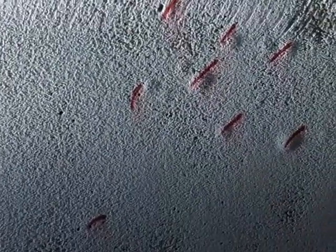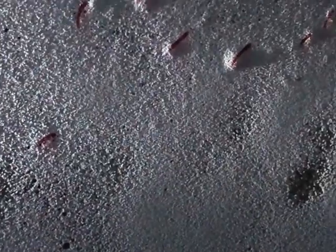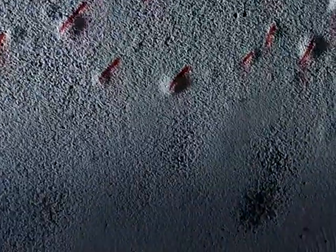Here's the process for checking your hull at night once it's been sandblasted and you've removed the visible blisters. Get a small narrow-beam LED torch and hold it flat against the hull. Where the red dots are, I've already identified them with texta marker — they're about to be ground out. But watch when you shine the torch down the side of the hull — look how much the blisters stand out. It's like moon craters. In daylight you can't see them, but with the torch flat at nighttime they're everywhere. It took about an hour each night — just walk along and mark every little lump with red texta, then grind them all out the next day.